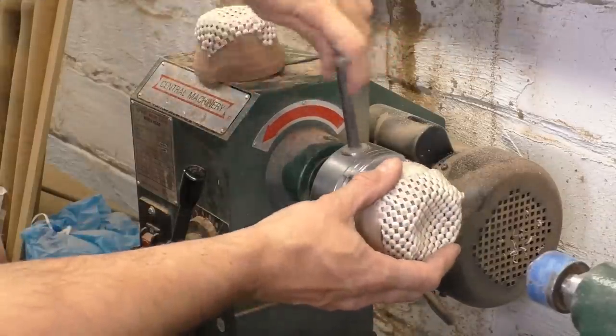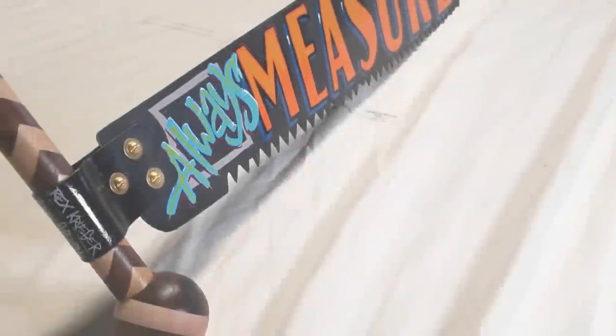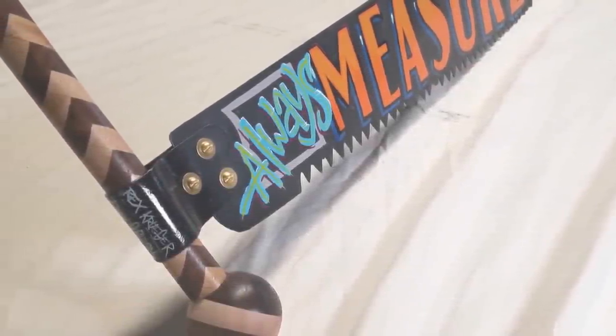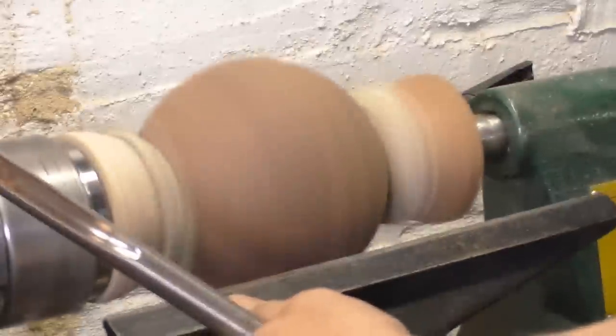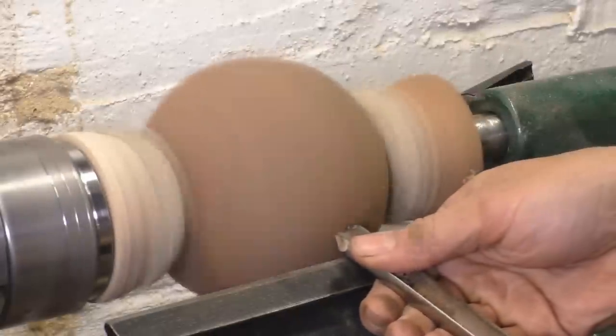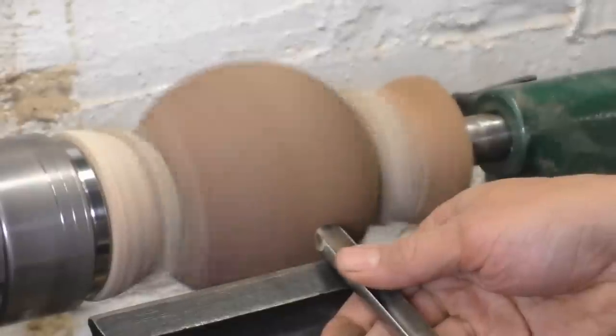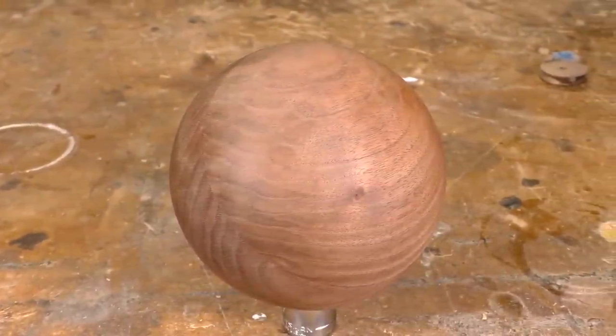Once I had a rough cylinder, I installed my sphere-turning cups on the lathe. If you're curious about this whole process, I've got a video where I made a decorative saw handle and turned a couple of spheres — I went into that in a lot more detail, link in the description. With the cups installed, I can rotate the sphere around any axis I want and work on the high spots. You get the sphere mounted and tightened down, turn off the high spots, stop the lathe, rotate it, turn a little bit more — keep going until it's just about perfect. Then there's some sanding. Honestly, just a ton of sanding. But when it's over, it's very hard to argue with the finished product.